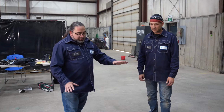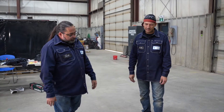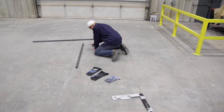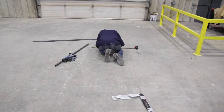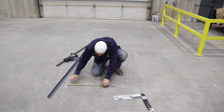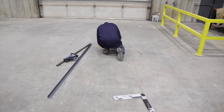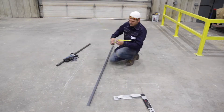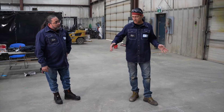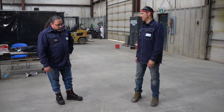So how do you decide where to start with the layout? It's always smart to start on a baseline. Even though this crack has some chips out of it, it is fairly straight, and I'm working off this baseline. Then I'm measuring up with my square, my angle finder, and even just a straight edge — I'm able to reproduce the layout on the floor.